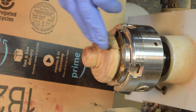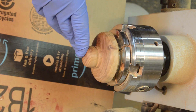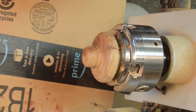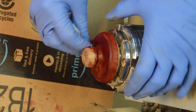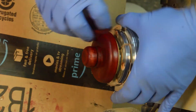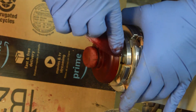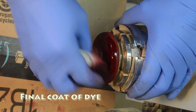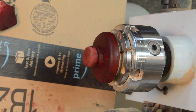I've sanded this all the way down to 400 grit and I'm going to do a little bit different approach to the coloring. I'm going to apply the red first, put it on everything, do several coats of that, and then do the black, and then do the gold. I've also not put any sanding sealer on this yet because I want this to soak right in. I'm going to let that dry naturally and then come back to do the black.